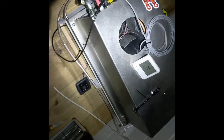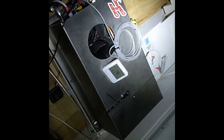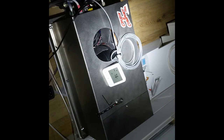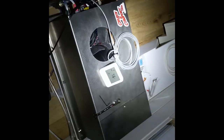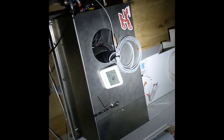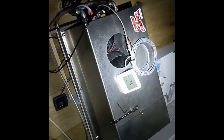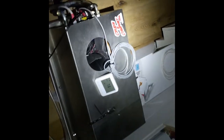There are two ways you can wire the condenser fan — one for maximum power where the fans go full speed below, and you can hook that to a relay and switch between two settings — either parallel or in series. The way I have them wired right now they're running full blast, but I can cut the amperage down quite a bit with the other wiring option. I'm going to put that on a switch next to where the Nest is going to be, next to the variable speed control. I'll explain how that works and show the variable speed control setup in the final review video.